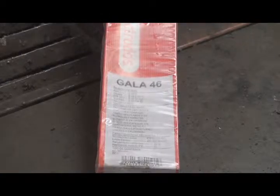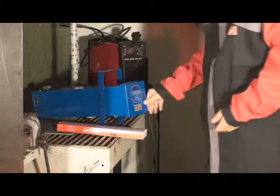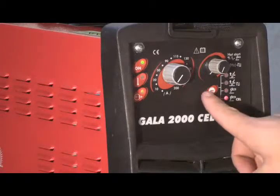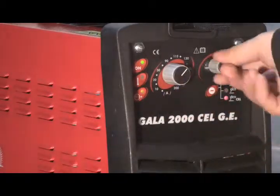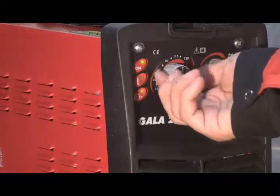We will check the data of the base material. Accordingly, we will select the electrodes, making sure that they are perfectly dry, using a drying oven or a stove. We will place the mode selector onto the welding position. We adjust the welding intensity to the electrode diameter — for example, 140A for 3.25mm. For our 2.5mm electrode, we will use 90A.